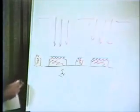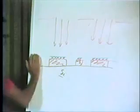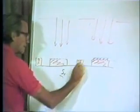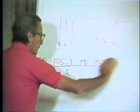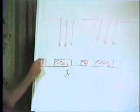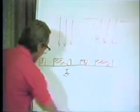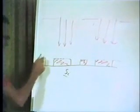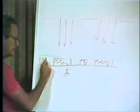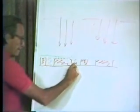And then the red stuff that I showed there is dissolved by another chemical, because it was only a tool and a scaffolding. And so we get to this picture. Remember that these are insulators, and this is a conductor. So the next step is to evaporate some silicon again and to make a contact. It goes on and on, and I'm not going to go on and on. But the next level is, say, silicon or transistor material, which is silicon with something dissolved in it, laid down here in a layer all over, filling all this.